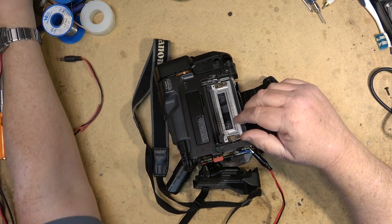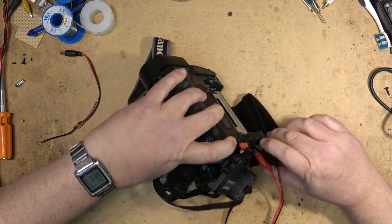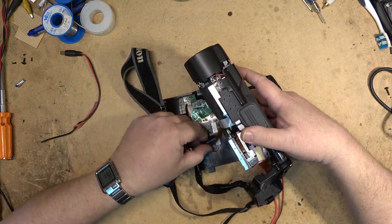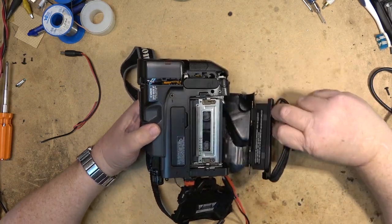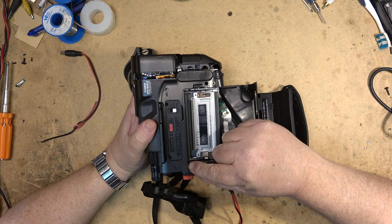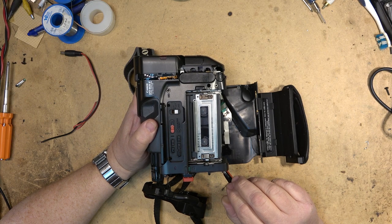Okay, there we go — 0.1. It's drawing about 300 milliamps and there's a light flickering here. I don't hear any sound from this thing, not emitting any sounds whatsoever, but it is trying to turn on. The power light is just kind of blinking like something is trying to start. It's going between 100 and 300 milliamps, about 270 to 340 milliamps.